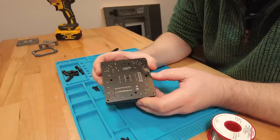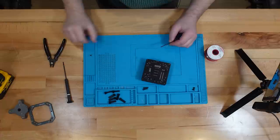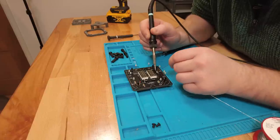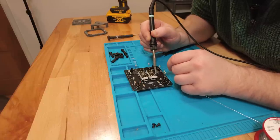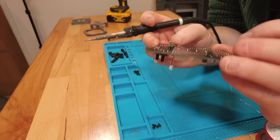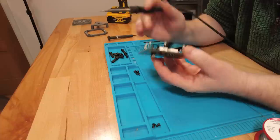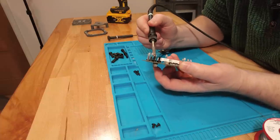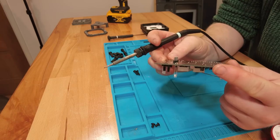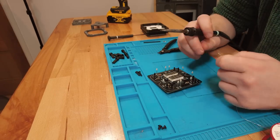There's the back of the board so far. Next up we've got some header pins so we can connect our cables. We can solder these from the front side. Once they're semi-secure — as you can see they are not straight — I can heat the last pin and bend them straight. Those pins look pretty straight; we can flip it over and solder the remaining legs.